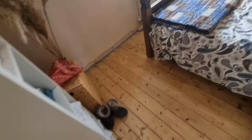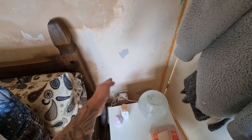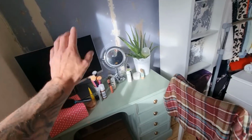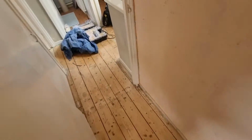So in this room, this is the bed, so that's the other side, that's the other double socket. Again, we're going to come off of there, bring a leg all the way across, pick up a double socket there, run straight along underneath here because the joists are running that way, and pick up a double socket in there. Weirdly, the party wall next door, because it's end terrace, is dot and dab, which makes it nice and easy for us. Come back out, back to there, and then back along, pick the leg of the ring back up. I'll keep you updated as we go.